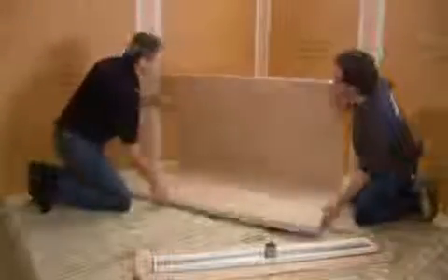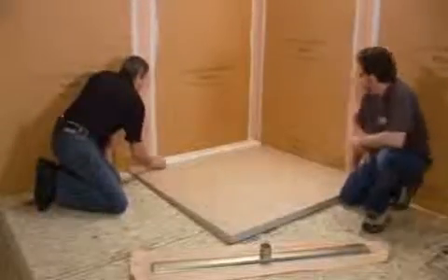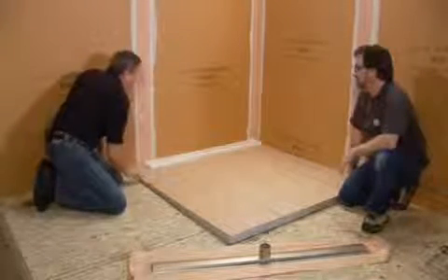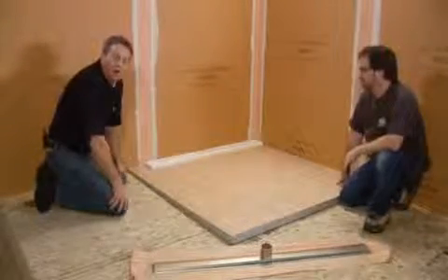Here's how it all goes together: we'll put the channel body up against the wall, then take the channel support and place it against the wall as well. That indicates where we need to cut the tray for the channel support. Once we cut the tray and set the channel support in flush, we're ready to place the KERDI drain on top and begin waterproofing.